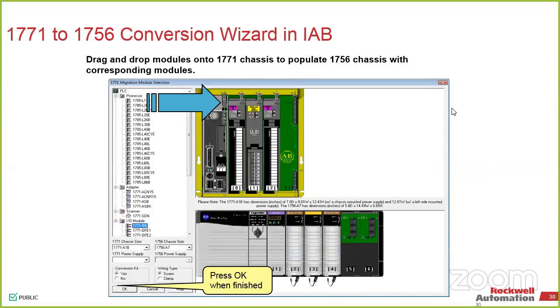The idea is after this, it gives you a bill of material with all of the parts that you need, including the cables. Once that's done, you turn it around to us, we give you a quote, and you now have the full system. It's the same bolt hole pattern. So you're actually removing the entire PLC-5 chassis, IO cards, everything. The only thing that stays is the little field wiring cable. If you remember, there's that little adapter bar there that has all the wiring. You pull that off and plug it into the new system. Ideally, the whole point is you don't touch the field IO wire.